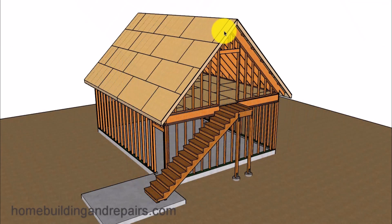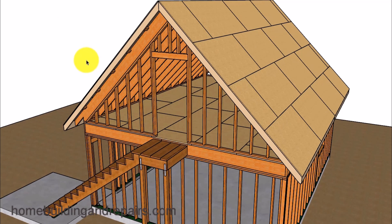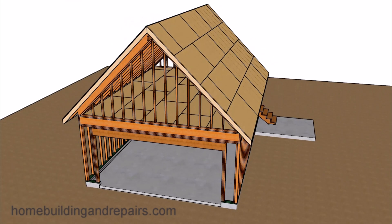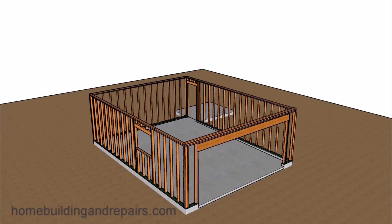Part 2 will provide more information about how to frame the rest of the building, along with making the roof a little steeper — we have a 12-and-12 pitch here, and the roof will be sitting on top of the floor framing. During this series, a couple of viewers have told me you can't balloon frame a wall and can't bolt the floor to the wall framing studs. I'm not here to convince you either way — my job is to provide different methods and yours is to choose which to use. Don't forget that building something like this might require structural engineering and local building authority approval.